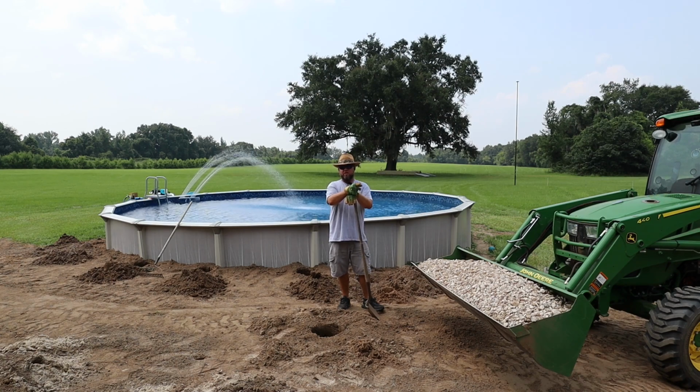So one of the most important things you can do, put loose gravel like this number 5 rock that I have right here in the bottom, pack it in. You want to do about a 6-inch gravel bed. Then you want to place the post on the gravel before you put any concrete around it. If you fill a hole with concrete, set your post in it, you have just messed up. You have sealed off the very end of that post.